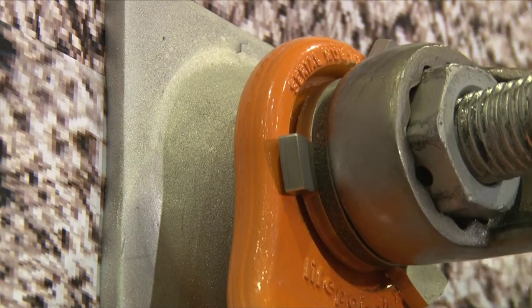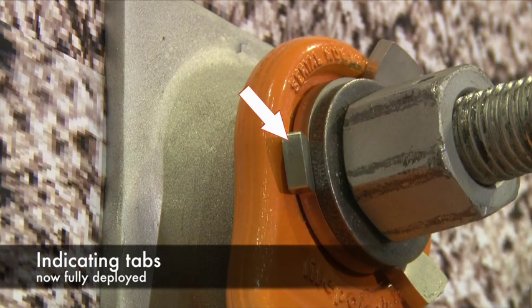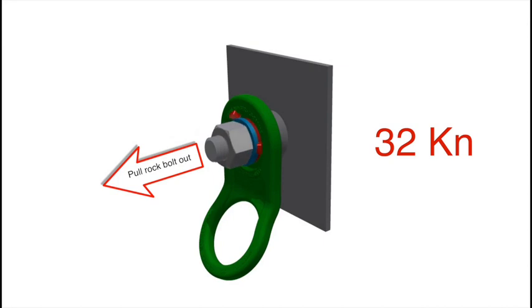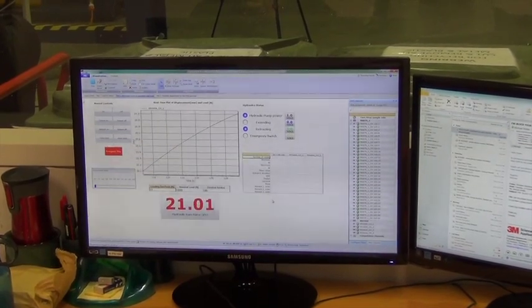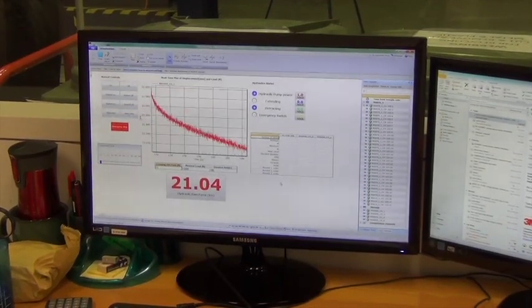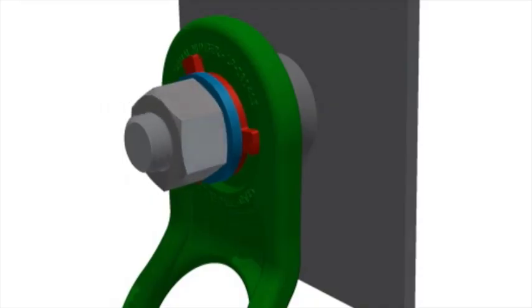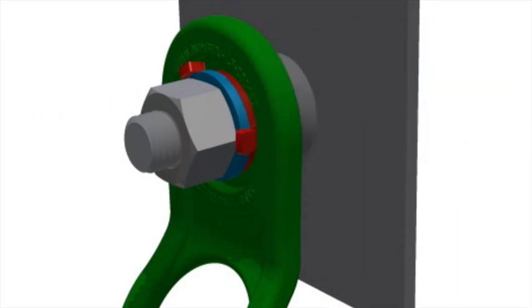When the nut is tightened and the load sensing washer is fully deployed, the rock bolt has been exposed to a force greater than 32 kN trying to pull it out of the rock. This certifies that the rock bolt has bonded in the rock correctly and that it won't fail under a 21 kN load, which the Lifepoint is designed to withstand as a two-person fall arrest anchor. The indicating tabs on the washer rise as you tighten the nut to indicate that it has achieved its performance.